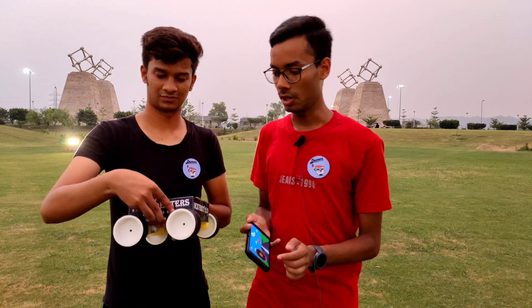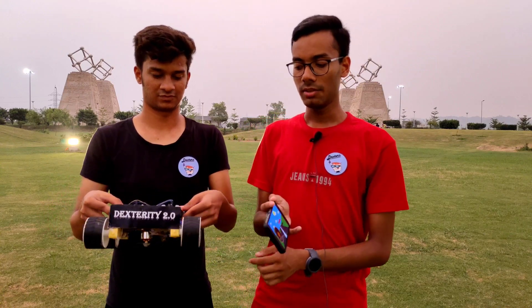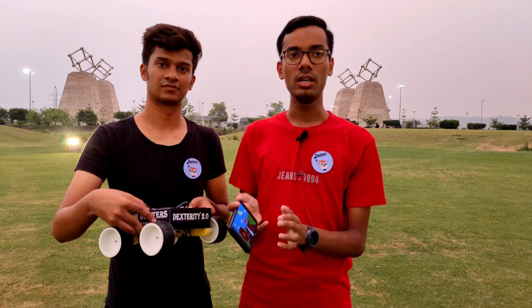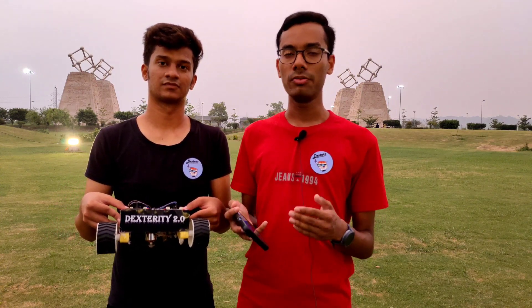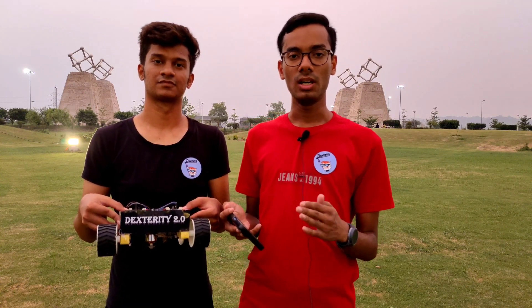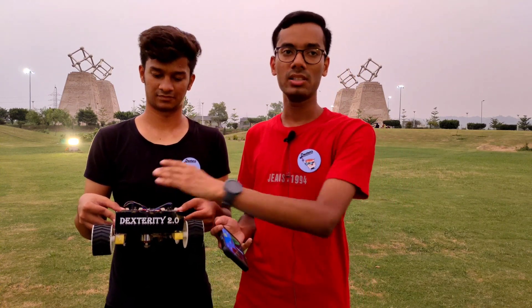You can see the sound as well. As I press the right button, some wheels rotate clockwise while others rotate anticlockwise. As a result, our robot can turn in a quite compact space. We have not implemented the kind of wheels used in cars, where an axle system rotates a few angles and the car turns in a large area. Our robot can rotate even in a small area, just as big as the robot itself.